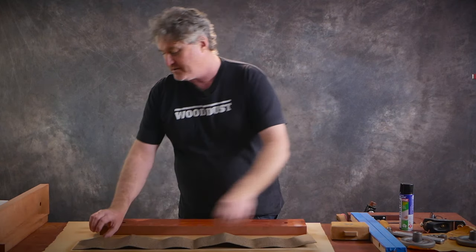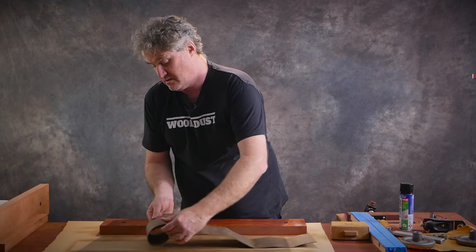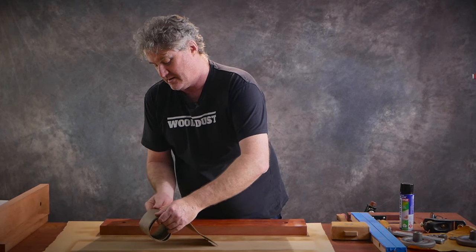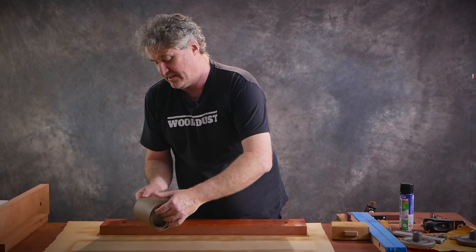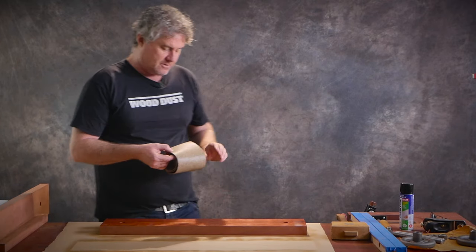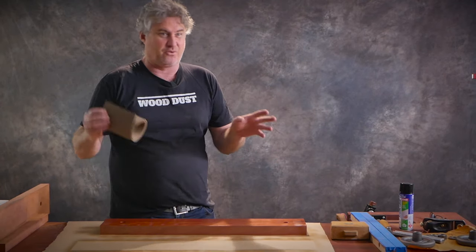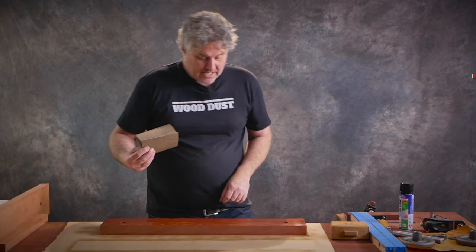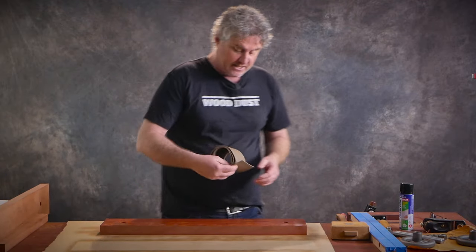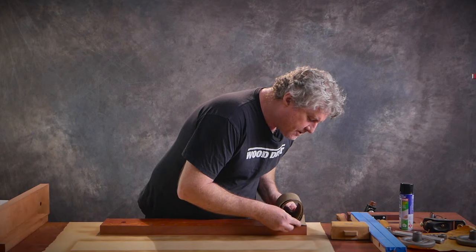So I'm going to try this technique, which is, the glue's on the upper side, to reverse roll it like so. And then what I can do is have it in a way that I can control what I'm doing, because once I place that onto the timber, it's going to bind, so we've just got to be really careful. I once made a table that was laminated with contact glue and it touched before it should have. Disaster, but we did survive. I'm going to line it up with the top edge, and the left-hand edge, so wish me luck. Right. I wish I was wearing my glasses.